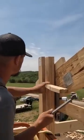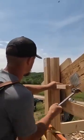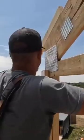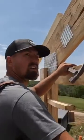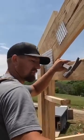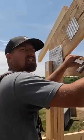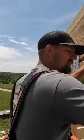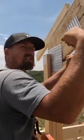Another key thing is to take a two-by-four and make a wedge. You'll place that wedge in at the bottom and hammer it in — what that does is it opens the pocket up so when your truss is coming down it slides in easier. This can be a really tight fit if you don't do that. Once we get the truss started and it's down quite a ways, we'll knock the wedge out.